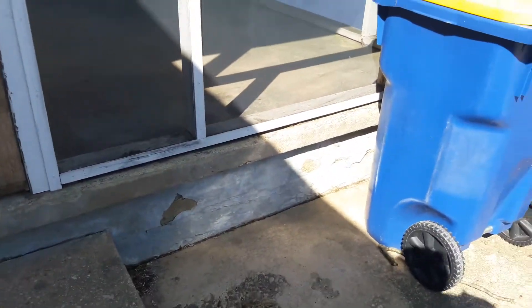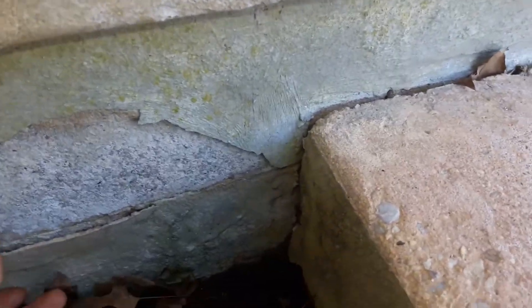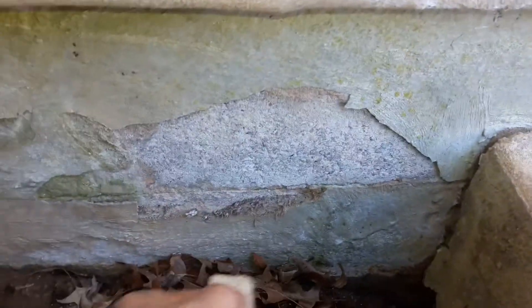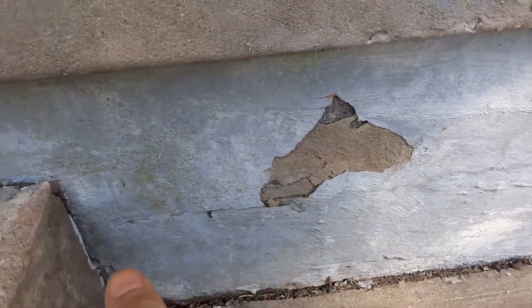Here's a porch — I get asked a lot of questions like 'is that bad, what do I do about it?' This is a concrete porch; we have no cracking on the deck, so we don't have any undermining. It's approximately a 50-year-old structure. The outside is just a veneer — a stucco, or rendering as they call it. That joint created the entire failure. It's just a joint, and this thin veneer of stucco couldn't bridge that joint and deal with expansion and contraction, so it created a fine crack all the way down, as you can see.